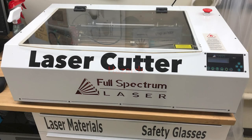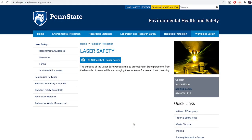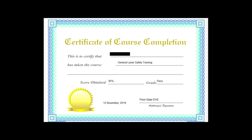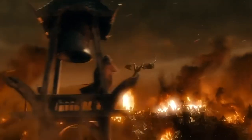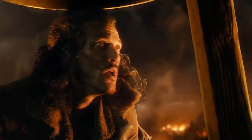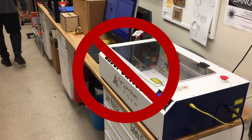The laser is safe if you make it safe, but you must be aware of what that means. Before you operate the machine, you must perform laser safety training and pass a quiz for certification at the PSU Environmental Health and Safety website. This website can be confusing, so we have instructions on the training page under Safety at the Makerspace website, and you can also consult with staff to help you get it done. Once certified with EHS and finished with this tool-specific training, you are cleared to use the machine. The most obvious danger is fire — you'll see we have a multi-tiered safety protocol, and you become the first line of defense. When the laser is firing, you must never leave it alone. Doing so will get you banned from Makerspace forever.